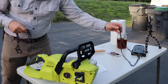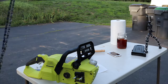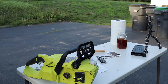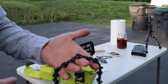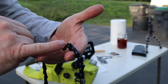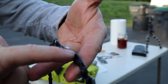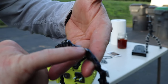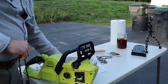We can compare teeth — the teeth are the same. Got a nice brand new chainsaw chain here. Cutting direction does matter — which way you mount it. The teeth have to be taking a bite out of the wood. This piece here controls how deep the bite is, and this piece is the actual part that takes the bite.